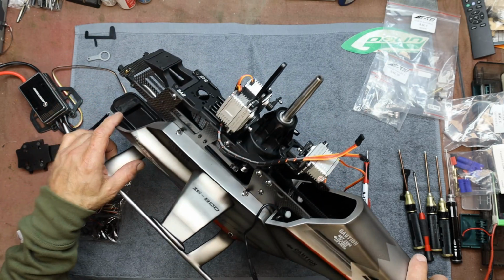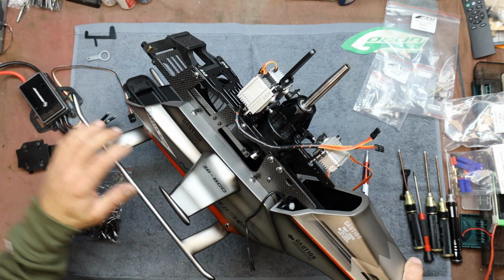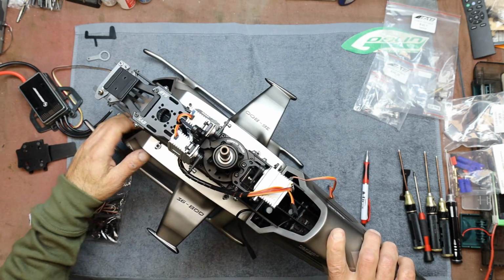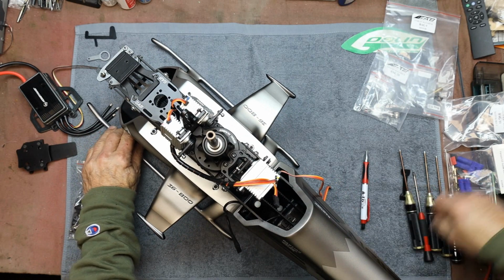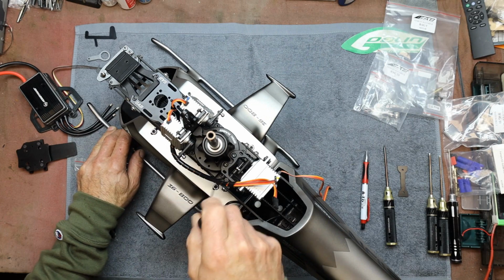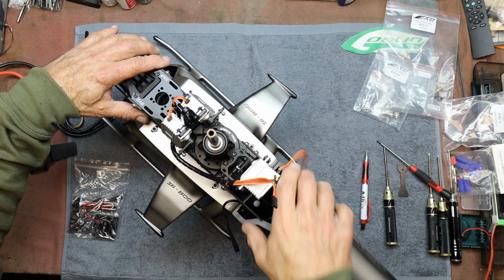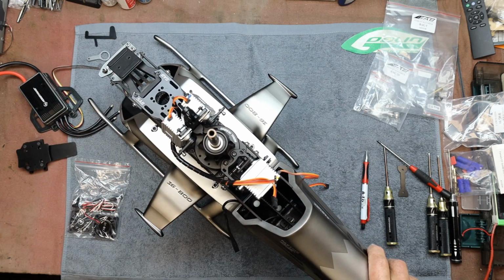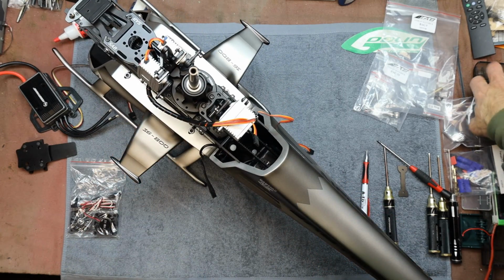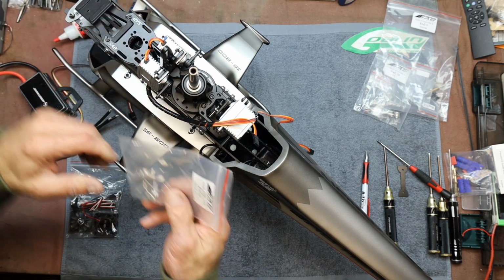I laid the motor belt in there, but I have a feeling I'm going to have to take these side plates back off, which is really just these 4 bolts right here. 1, 2, 3, 4. Loosen those bolts or take them out, and then these mechanics will slide right out of there. The reason I'm saying that is I'm not going to be able to fit the motor and this.